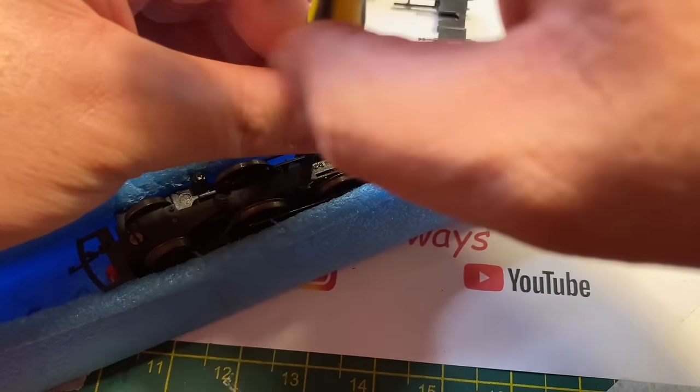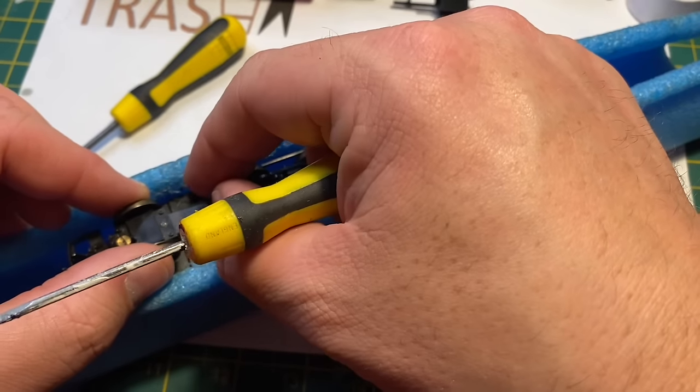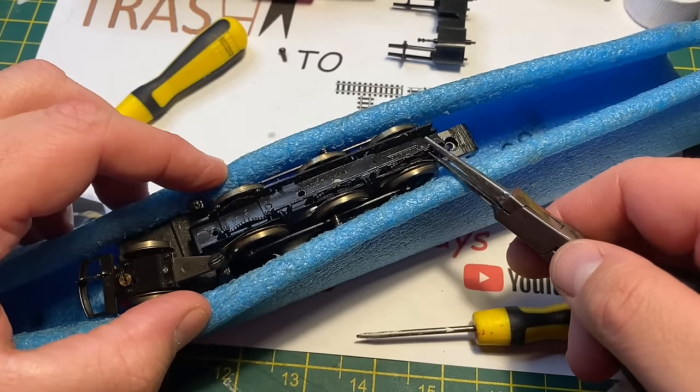I reattach the orange and grey wires back to the motor terminals and will give the decoder a test on my layout controller. I've got a feeling, having looked at the decoder with no burn marks on it, that this is one of those that doesn't support DC running — which is why it wouldn't run with a battery test. Now I've got the loco in the loco cradle because I need to have a look at these axles and under the keeper plate. If there was that much oil on top of the model, I dread to think how much is under here. The keeper plate unclips and unscrews and lifts away.